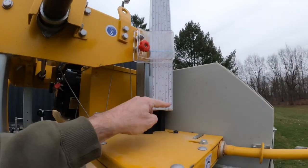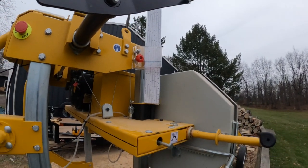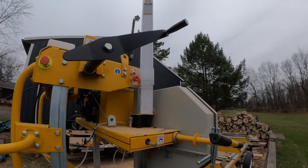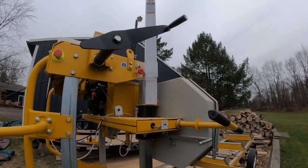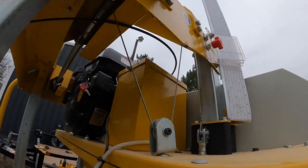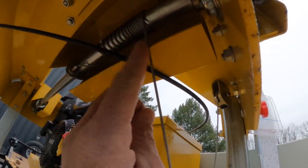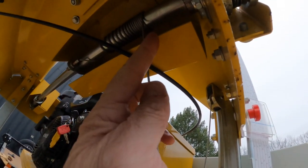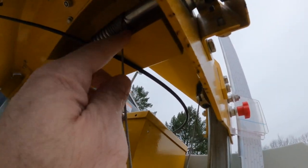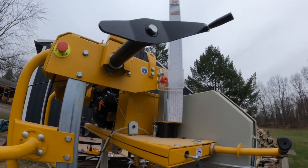It shows we have another six inches available, so you could potentially go up to 82 inches total height. So if you're building a space for this, give it at least 82 inches — I would go with the standard 96 personally. Now let me tell you why I don't want to go much higher: this pulley is rubbing just ever so slightly right here. This probably needs a notch cut out or another pulley added, because it's doing it on both sides. So that is the total height.